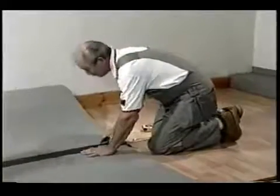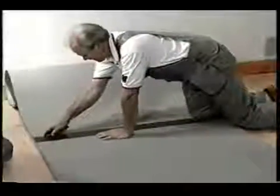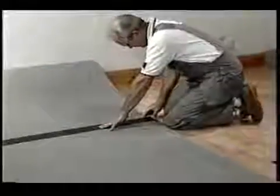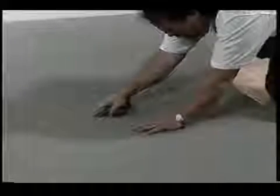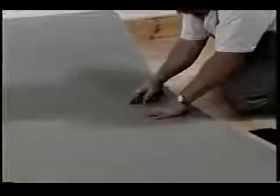Once you've taken the measurements, you'll need to be extra careful to perform the cuts with exact precision to ensure proper fit. First, score the material using the utility knife to trace the exact cut. Next, use a hook blade holding the knife at an angle to slightly undercut the edge. Cut completely through. The hook blade must precisely follow the score line made with the utility knife.